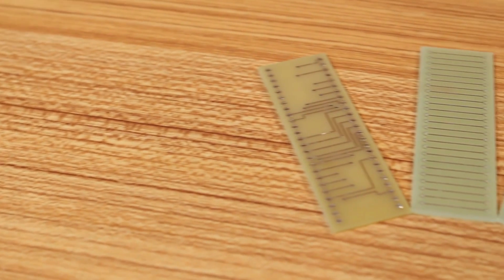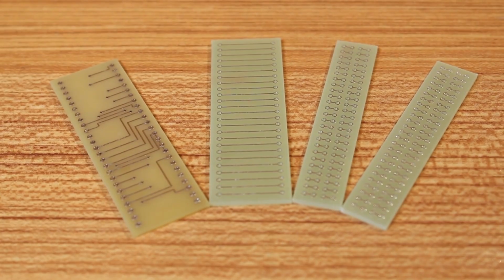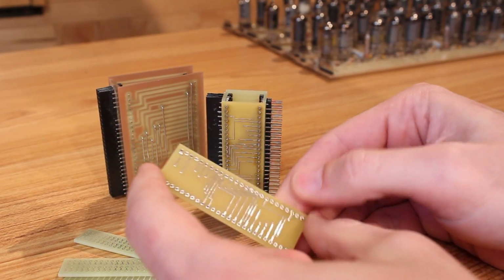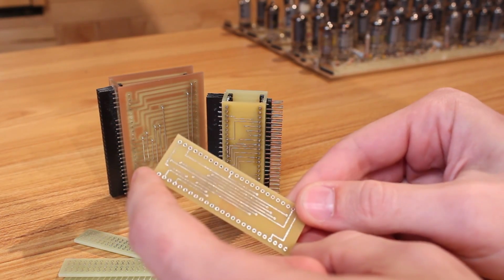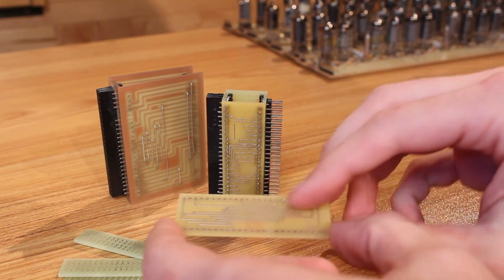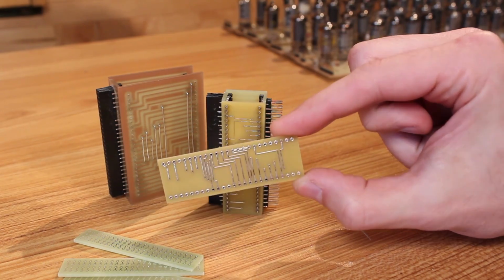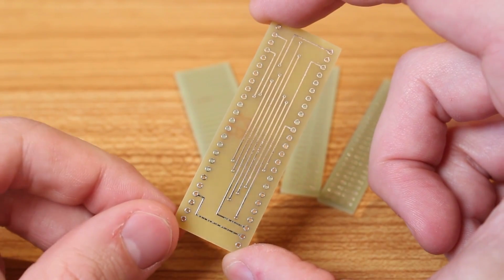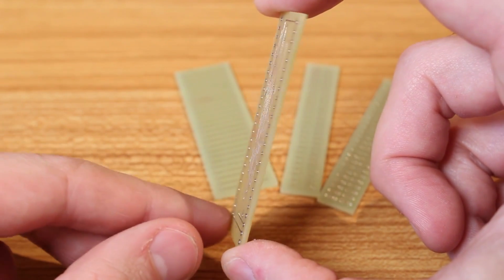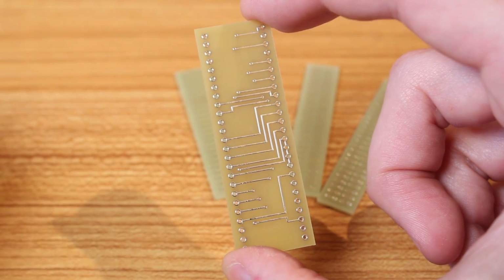So, well, I took them up on their offer, and you can see that I actually have 3 different single-sided PCBs, and then I have 1 dual-sided PCB here, and this is just changing the pinout of the floppy to match the pinout of the FFC card. And you may notice that there is no silkscreen and no solder mask, and that was actually intentional. I really wanted to see what PCBWay's manufacturing looked like without a silkscreen or solder mask.